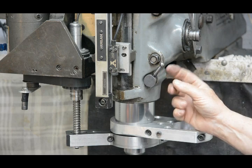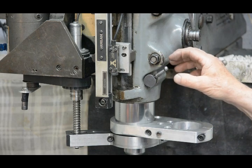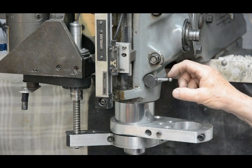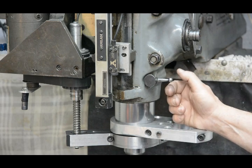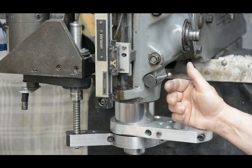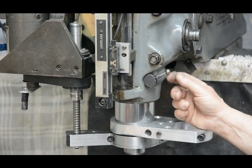The problem I found was that gravity — in particular when there's a little bit of vibration from the machine running — will sometimes bring that down and not exactly lock the quill, but make the quill stiffer to move, which is just more wear and tear on me but also more wear and tear on the machine.